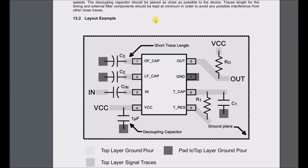So anyway, what happens is when you get an input that's a match with the frequency that the internal oscillator is generating, then pin 8 will go low. And because of that, this will turn your LED light on if you've got one attached in this resistive load, whatever you call this. But if you're hooking this up to, say, an Arduino or something like that, I guess you could hook it up and have your microcontroller monitor when this pin 8 goes low. And that would make this integrated circuit a very useful chip.